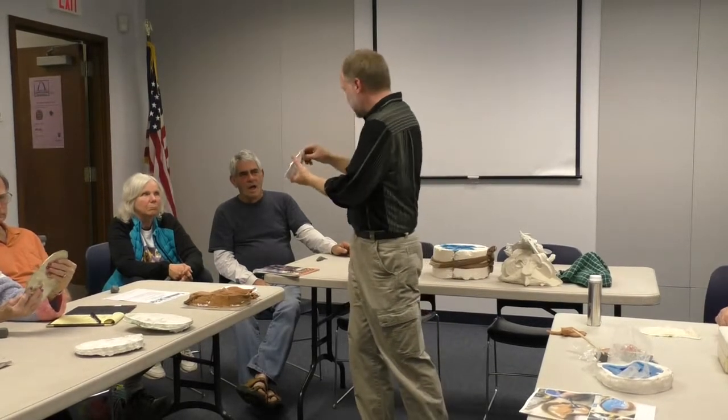But now that you've got something flexible, well, now you've got a whole new set of problems if you try and cast it. Because now, if you try and cast into this, it's flopping all around. You pour in heavy plaster or something like that, it's not going to hold the original shape. And if you lay it down, it's bumping up because of the table surface, so you've got to do something to make that latex hold the shape you want, yet still be flexible.